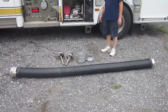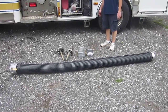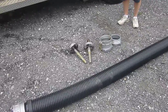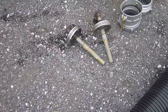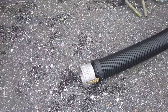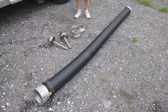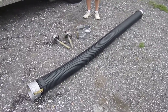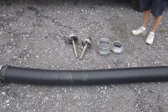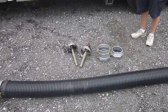In this clip we're going to look at jet siphons. It's not much different than doing a jet siphon on threaded fire hose. The issue is that we have threaded jet siphons and we have cam lock fittings. Remember, there isn't a direction to the suction hose — it doesn't matter what end of the suction hose has the jet in it. A lot of this is going to be based upon how the operation is going at the time of the incident as to what adapters you have left.